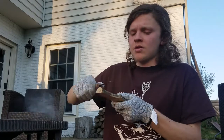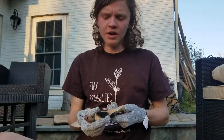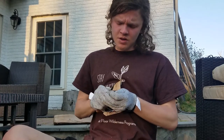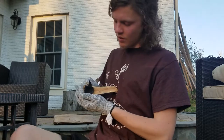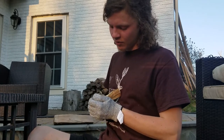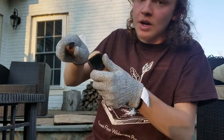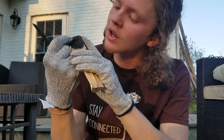I do carve both ways, so if you're making hard strokes make sure to carve away from yourself. I'll take away all the bark — though you may be able to leave it too if you like the color. I only carve towards myself very softly when making fine detailed strokes. I like to put the spoon up to my sternum — that gives me extra control for really detailed cuts without accidentally injuring myself. As I carve, I'll focus on the handle first, slimming it down so I know the parameters of my spoon. Once I have the handle I like, I can focus on the top and carefully carve around the head to get the shape I want.